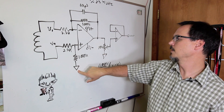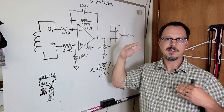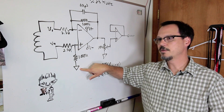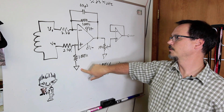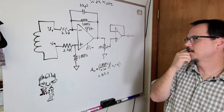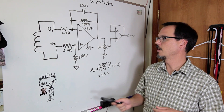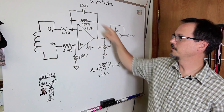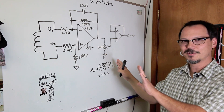I'm pretty convinced you can actually do this with a single positive supply. You'd have to set this reference to the midpoint between plus VCC and minus VCC, which is basically ground. But you could also set it to a reference voltage — if my supply voltage is five volts, I have a regulator set at two and a half volts and I can still get this output. I'm not convinced you don't get the benefits of common mode rejection without the two-supply setup, but somehow this feels more right to me. Somebody's going to have to step in and tell me why this works so much better.